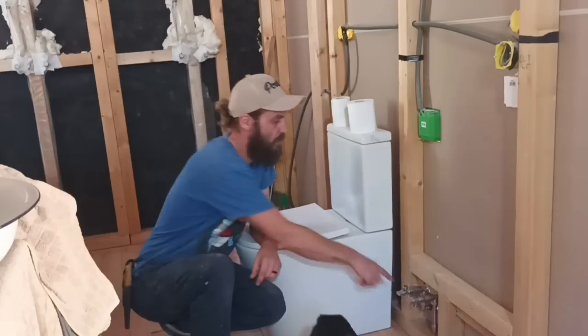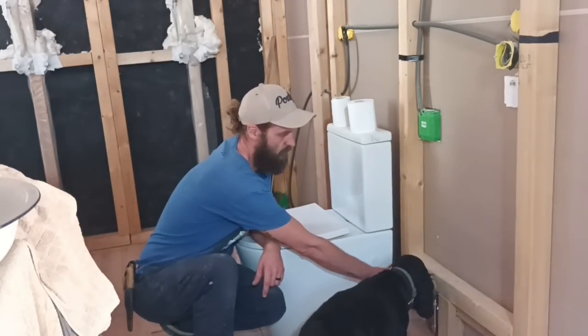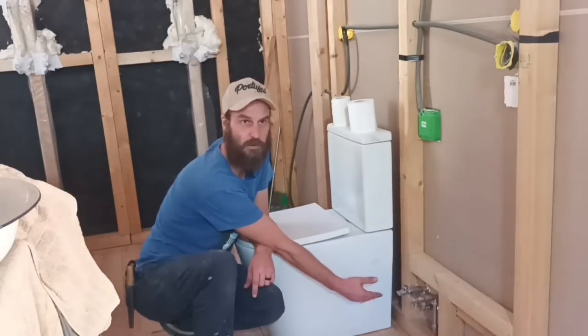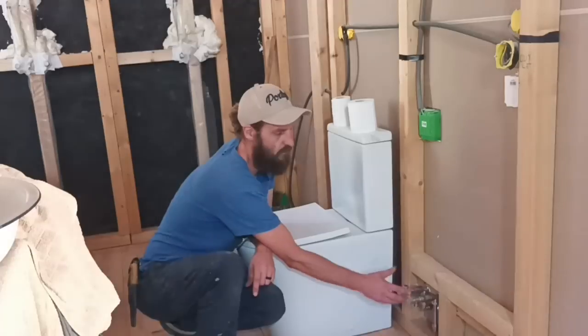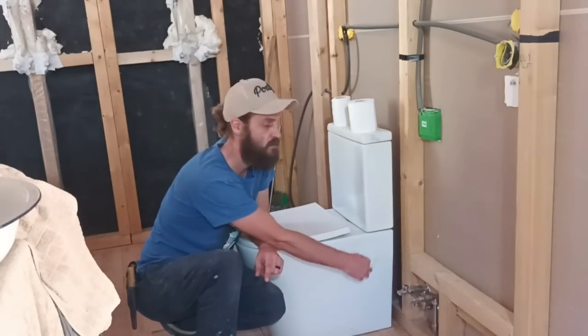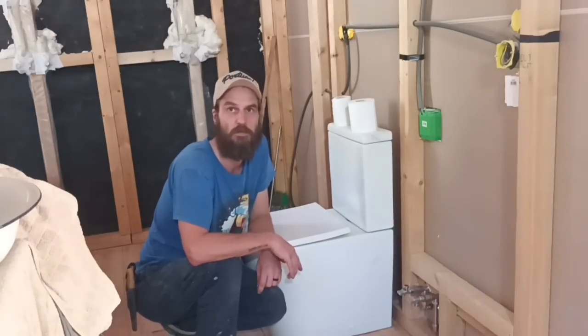One more thing to say, maybe, is that since we have hidden pipes behind the toilet here as well, in the walls with connections, and we want to be able to see if there's a leak and change them, we just created a small false wall that you just have to attach a 20x20 square, so you can take it off and check the pipe. So we always have access to the pipes.